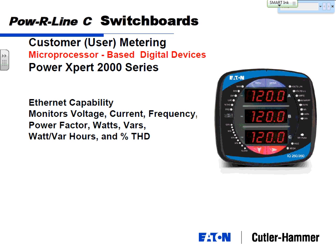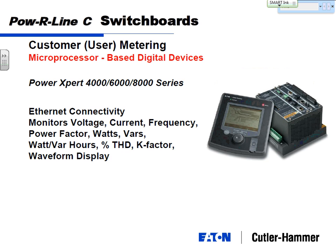So I'll call those two energy meters. Just a nice basic look, a three-line LED display. There's also an advanced meter that all the manufacturers have that I would classify as a power quality meter. So there are energy meters, lower cost, less functionality, and power quality meters, higher cost, more functionality.